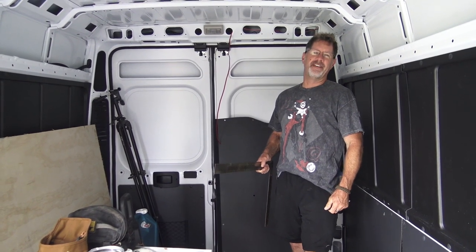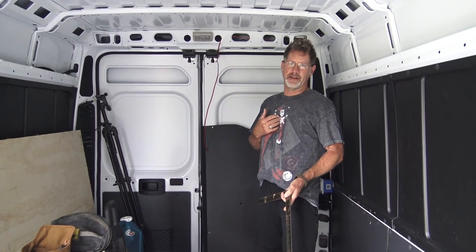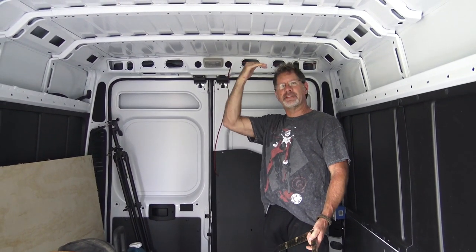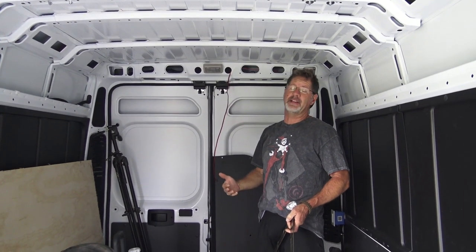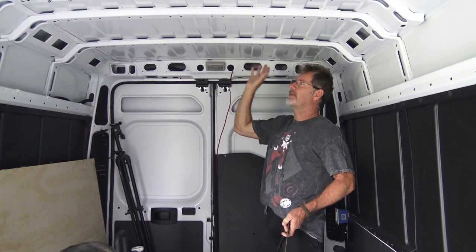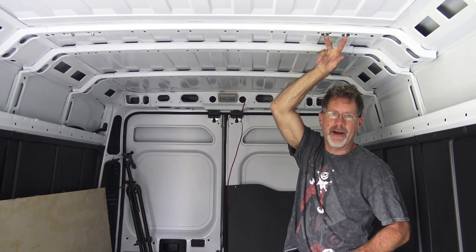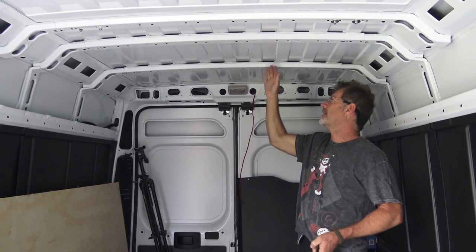When installing a fan, whether it be Fantastic or a Maxxfan, where I usually start is underneath. In this particular install, we get the benefit of seeing how the ceiling is constructed. Sometimes there's materials here and there's wires running the length of the vehicle and we can't see those, so we have to do those installations differently. This one, we can see that we're out of trouble. I know that our solar panels start here because this is our last Z-bracket mount and go forward. So I know that we're out of trouble on the solar panels from here back.